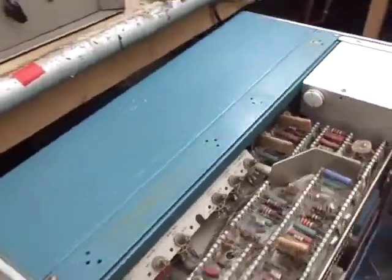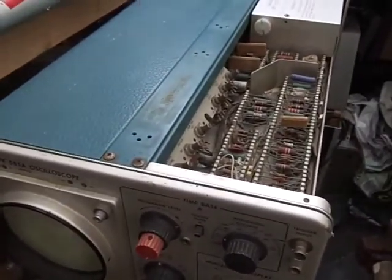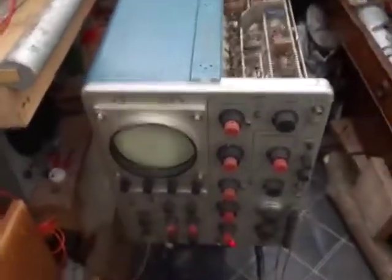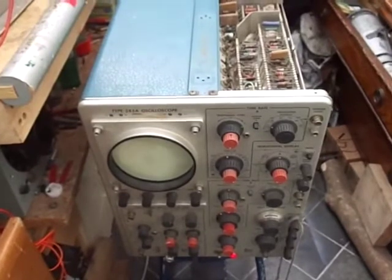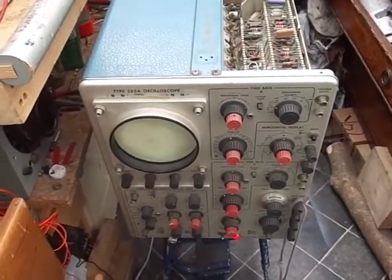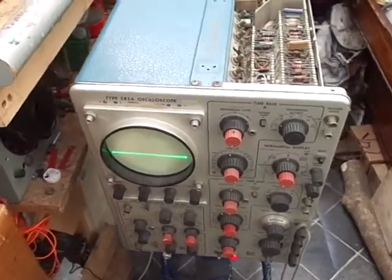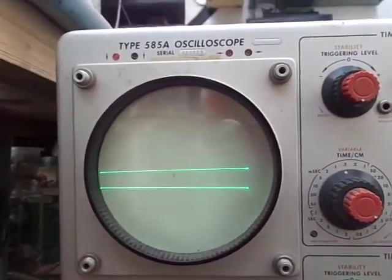Right, we'll start the scope up so we can show you what the situation is. Got the voltage set for the spur winding. It's a bit noisy — big fan in it. It takes about a minute; there's a delay circuit that has to click in after about a minute. What was happening before when troubleshooting was that the delay would kick in, then bang — click off again. Went through about 100 fuses. There we go.